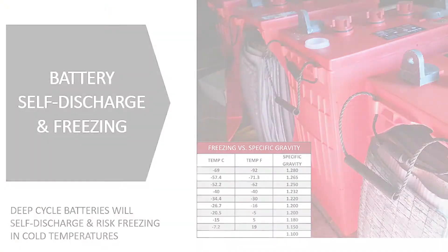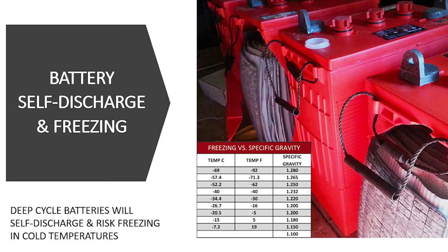It all depends on the particular scenario of that install. In most cases, a seasonal property would be used during the summer months, and then you would have several months of usage crammed in there. After that, you would have the system in storage for a long period of time. When you're storing a system, especially with regards to the batteries, it is best to make sure that those batteries are fully charged before you put the system into storage, to prevent the batteries from over discharging. Batteries do self-discharge, and so if a battery is fully charged and then you just disconnect it, it will actually self-discharge naturally.